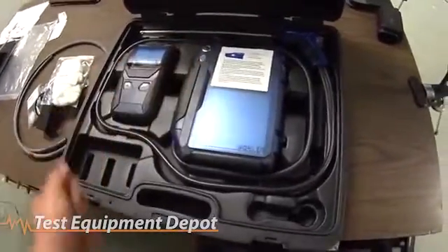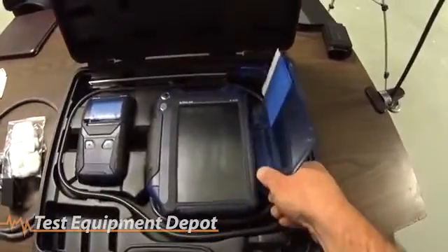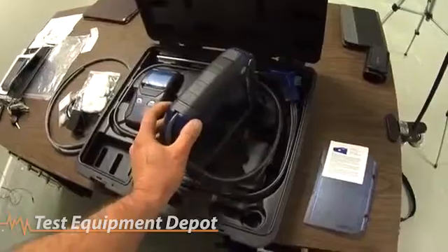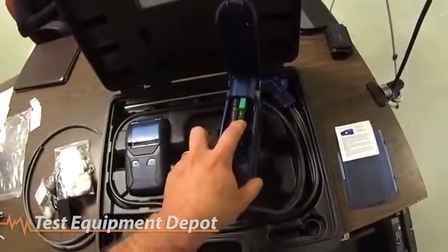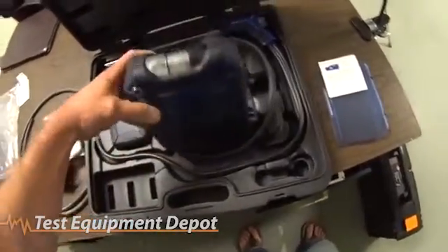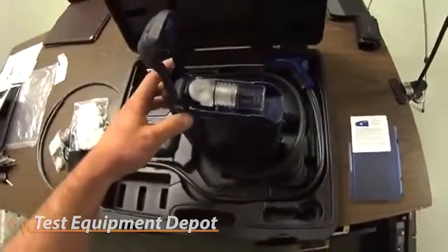The star of the show is the A550L itself. You've got a cover that protects the large touch screen, and the cover can be removed — just pop it out of the little clips and you have access to the screen without any obstruction. The design is very modular in that you can change your accessories pretty easily. Pop the side open and lift it up and you've got two connections: one is a K-type thermocouple connection and then there's a hose connection for the pump. This section is spring-loaded to allow you to open, close, and lock it down.